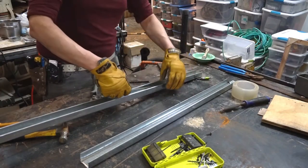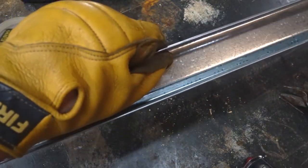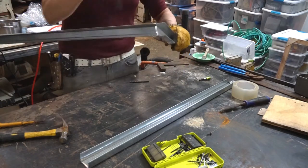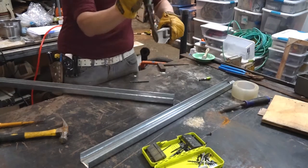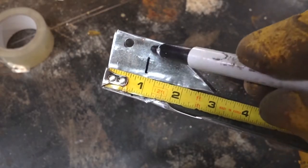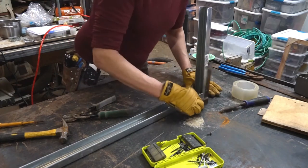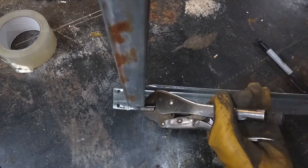Now we're going to cut a 15 inch piece. Again, you first cut the sides as close to parallel as possible. Like the frames, these are designed to absorb error. We want to mount this an inch from the edge — you put this in sideways then spin it nearly in place. This needs to be more or less level when you do this, but don't worry too much. It's going to move around a lot as we work and we are going to set the angle properly in a little bit.